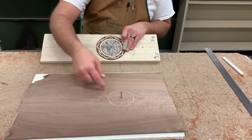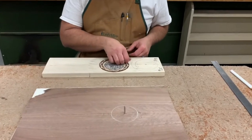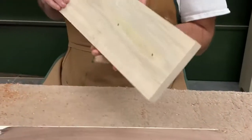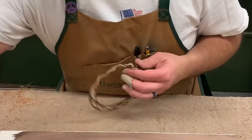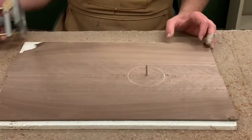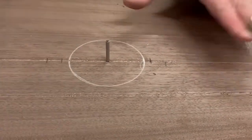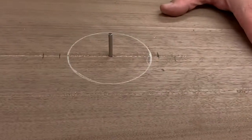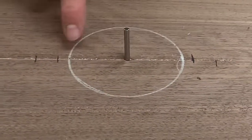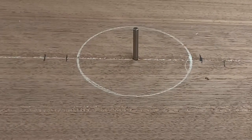There's going to be a ring of wood from the top — in this case walnut — before the rosette. If you aren't doing a rosette and just want to do the sound hole, you can do it similarly, or you can do the sound hole on the laser, which means you're not committed to a perfectly round sound hole. I have my center line on my top, the sound hole center, and a drill bit with the designated bit for the pin.